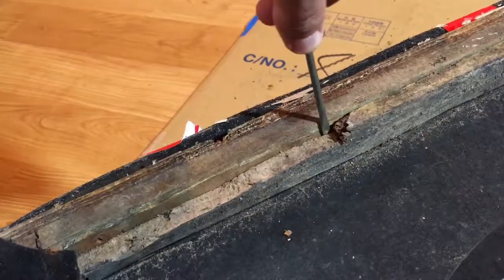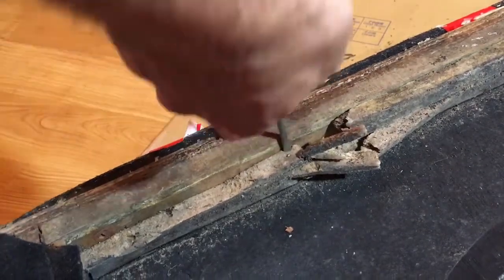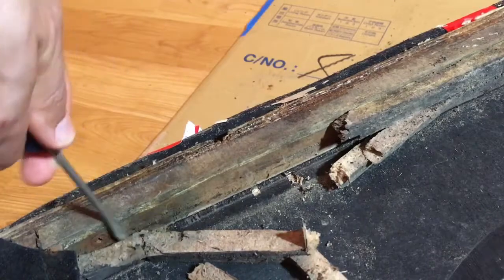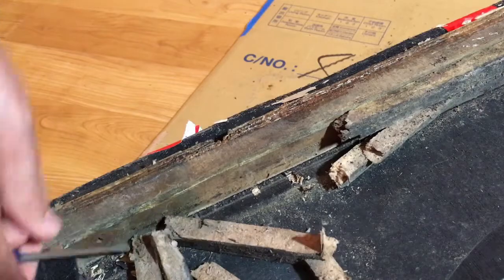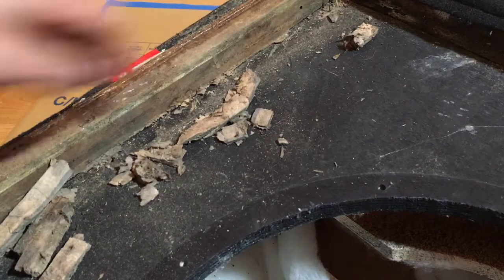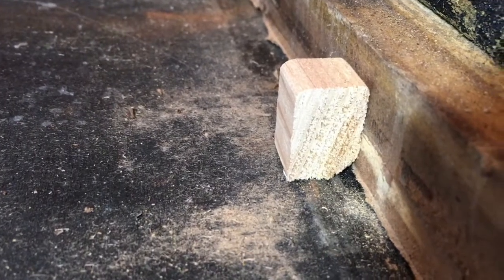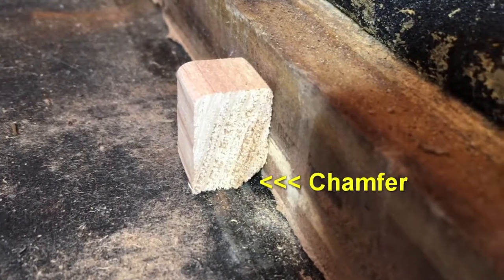After repairing the delaminations, it was time to yank out the swollen and brittle MDF. Try not to cringe at how easily the MDF comes out. Luckily the rest of the box is plywood and solid wood. I don't understand why Hartke would have used MDF here — oh wait, yes I do. It's cheap. I'll make some replacement pieces, this time out of some solid wood I had kicking around. I cut this little end off to show the profile. Down in the corner there's a chamfer to prevent interference with any debris or gunk I failed to remove. The opposite end is rounded over for aesthetics only.